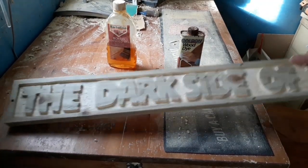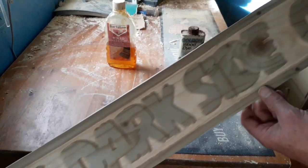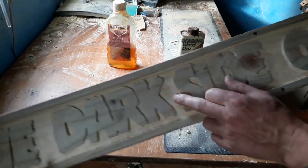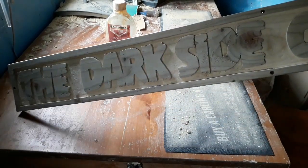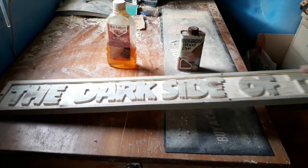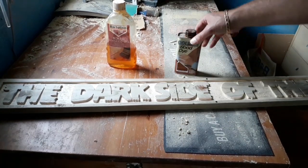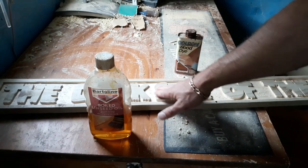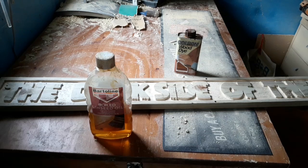We're on the raw wood stretch now — I've cut the top off so it all fits in nicely. I'm going to try a bit of mahogany stain on this. Normally you can paint the background black and then sand it over to leave the nice lettering showing. I'll try some mahogany wood dye, and then I like to put a bit of linseed oil on just to darken the background behind the letters. I'll sneak a bit of dye in to fill that in at the same time, then we'll see what we end up with.